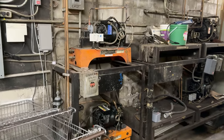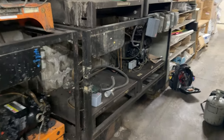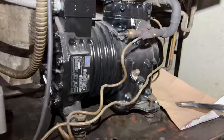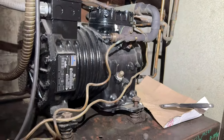We're doing a fresh meat case here that's not doing so well. This is some of the older equipment I get to work on. Down here on the bottom is the compressor for the fresh meat area. It's not running and it's warm. The oil is kind of low, like it's been cycling off on a pressure switch. We're going to do a leak search on it.